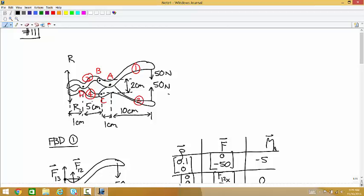And so what I did in my solution was I locked it in place. I said, let's say this pin joint attaches it to the wall. And let's say that this one, because of symmetry, as this opens and closes, this pin will change its horizontal position, but it won't go up and down. So I lock this to the wall to limit translation. And then I put this in a pin and slot joint that could slide along the wall. That restricted those extra degrees of freedom. It introduced 3 new variables that we then had to solve by isolating the 4th body. It's sort of unnecessary work, but when I looked at it, that's what made sense. That thing can move and rotate, so let's fix that. Either of those two approaches will work.